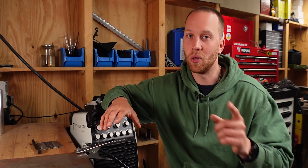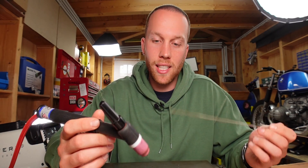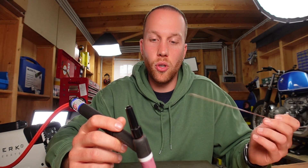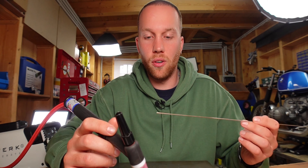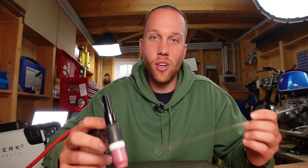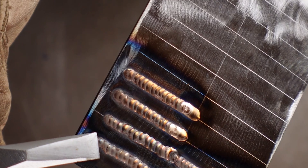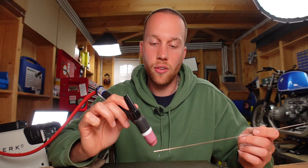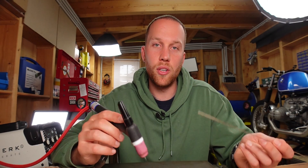When it comes to the technique of TIG brazing, it's actually much more similar to TIG welding than I thought. There are two different ways of introducing the filler rod. The first is the lay wire technique where you just leave the filler rod in the joint and go over it with the torch — that works, but I don't like it aesthetically. Dabbing the filler rod gives you a very nice uniform-looking bead. One thing I've noticed is that you have to keep your torch a little more straight, because silicon bronze melts so fast. If you angle it too much, the filler rod just melts right on there, creates a ball, and doesn't come off.